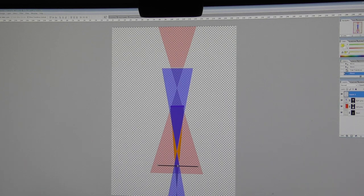I keep stressing the point, it's not light rays that stimulate molecules. Look, there are light rays out here. They're pretty useless. It's the intensity of the light rays that's doing the damage. And that's the big issue that is not accounted for when these lenses are designed. They have to be designed with a fixed focal point as though they are going to be used in a camera, a microscope, or maybe something like a projector. But a laser beam doesn't understand those rules. It's got its own rules, and it exploits the weakness, the spherical aberration weakness of all lenses to produce a cutting action, as I've described here.